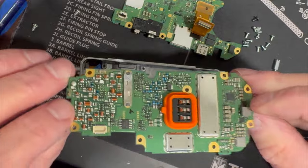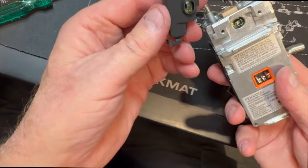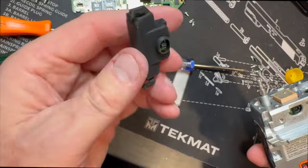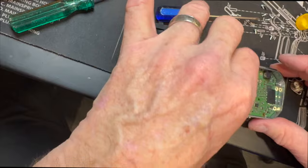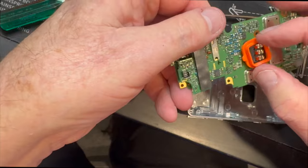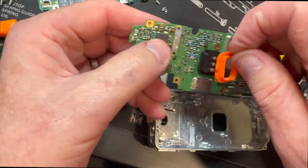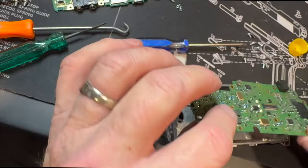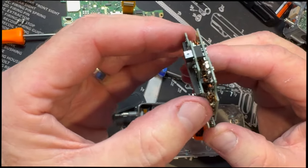Now I guess we're going to try to put it back together. We went ahead and took the long-wave antenna out for HF. We've loosened all the screws and unsoldered the antenna connection. Now we're going to pop this out — unlike the 74 where you had to play around with it, on the 75 all you have to do is take the sealing ring and put it back right here, then when you put it back together this just goes right on top. We'll show you the board where the long-wave antenna is connected.